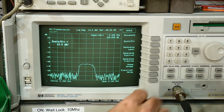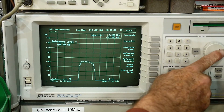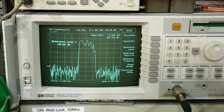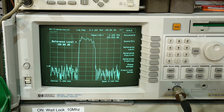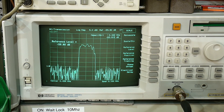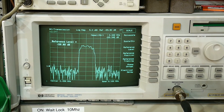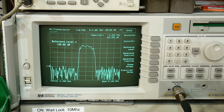So now what we'll do is take it off of this machine and measure those two resistors, then we know what the impedances are. We're not actually measuring the percent transmission of the filter, but we are measuring how it would react in its environment where the impedances were correct. We would have a very nice, flat filter — it would look really, really good.